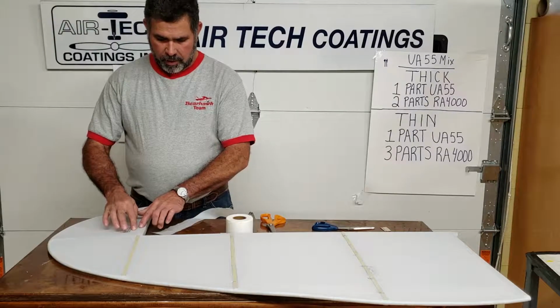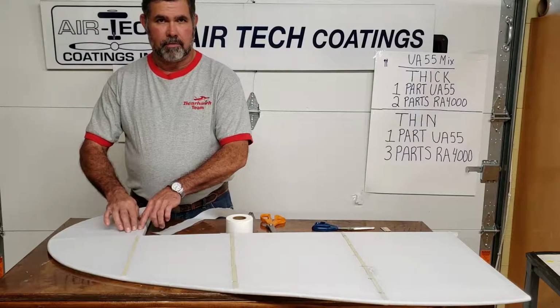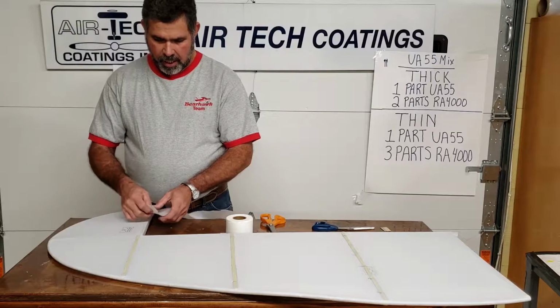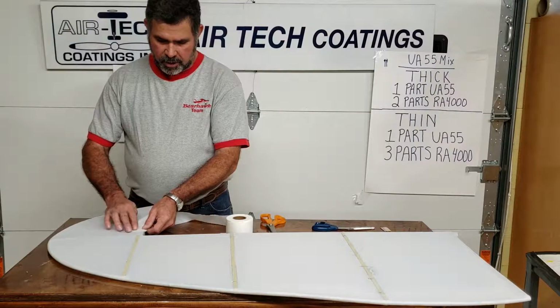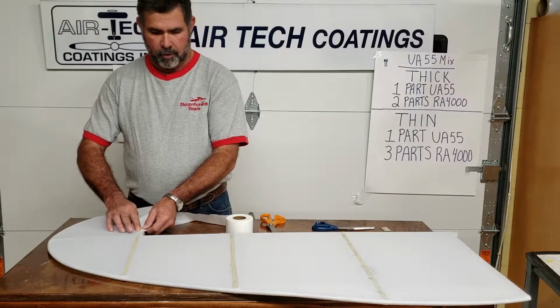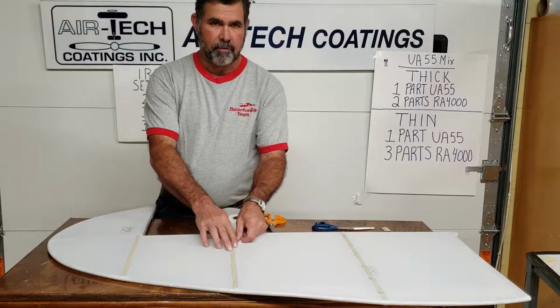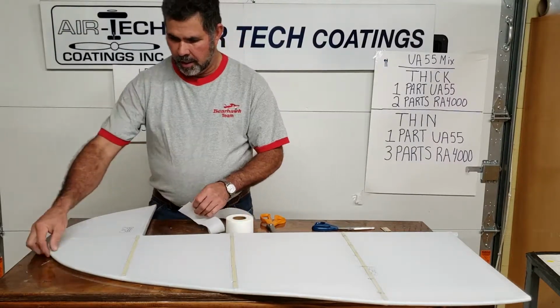But you know, you'll have that little hard point that is doing a lot of vibration and everything, and the pinking tape, what we call it, putting it on there, bridges that spot and just gives it like a double layer of covering, just kind of reinforces that. Also, it's for covering all of this reinforcement tape and stitching that we did, and all around your edges.